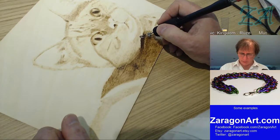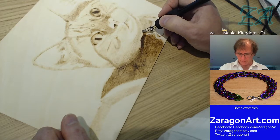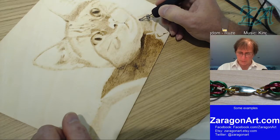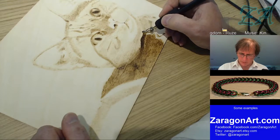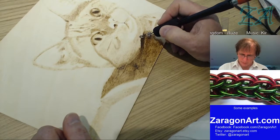And actually, as the camera, I do have a camera module for the Raspberry Pi, but it's an NoIR one. So that means it's got no infrared filter on it, which to some extent may or may not make much difference. Except for things like this, you may actually see the glow off the pen, and it will misrepresent that glow because it's in the infrared, being heat. But that might be a fun thing. At least it will give me a chance to actually try out that camera, given that I've got the module in the first place. I'm sure I've got a Raspberry Pi around here somewhere.